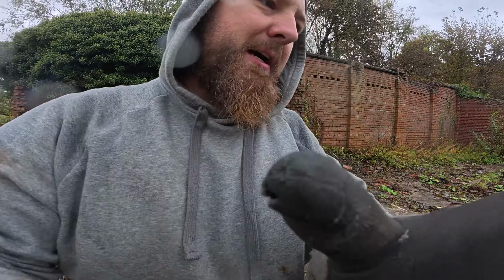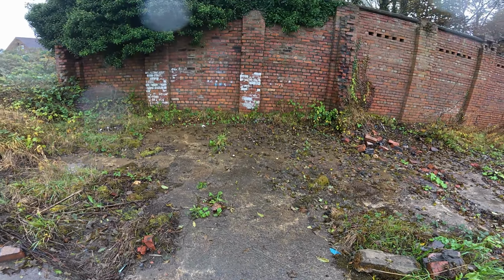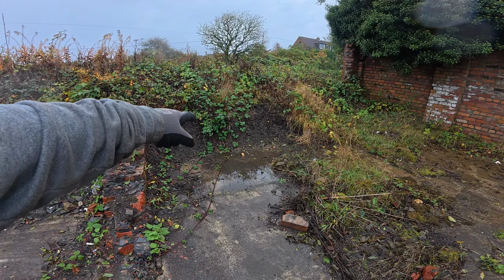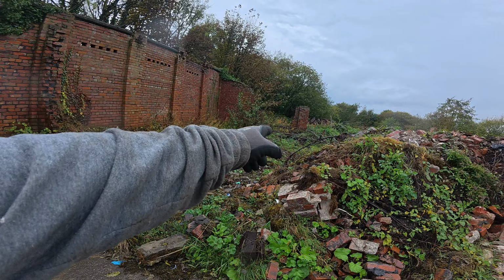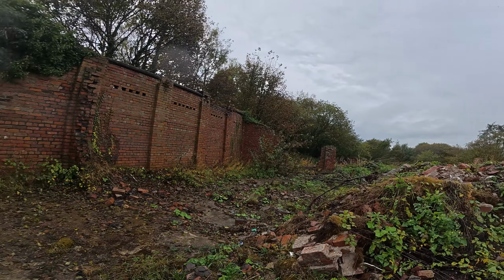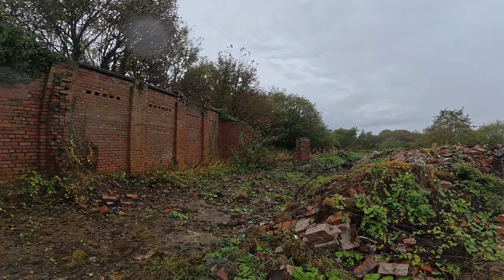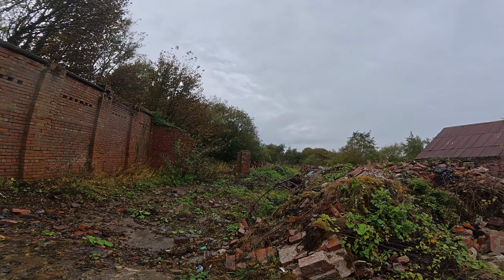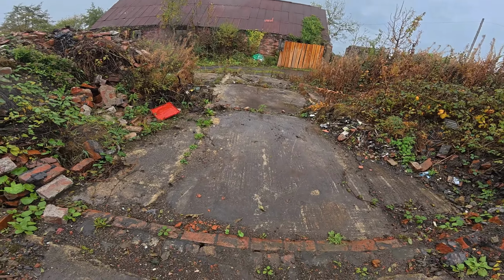I've already measured 2 bits out. So first bit here, that's 5 meters from that wall to this brick. Alright, so that's workshop number 1. I'll have a wall there. I'll have upright beams that I will mill running all the way across here, and then across the roof I'll mill my own beams again, something like 9x3s, 9x4s. 9x4s sound good. So I'll do some 9x4s all the way through.